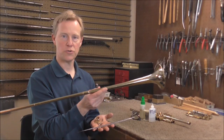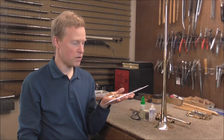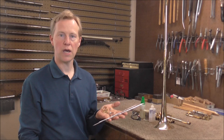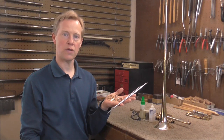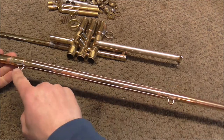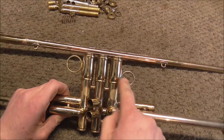The bell is in one piece and straight again after many years of being bent. I have six more pieces to solder on the instrument, but I've done so much soldering lately that I'm not going to bore you watching me solder six more pieces — I'll just do it and show you what it looks like when I'm done. Here is the trumpet: I soldered on the two flag hooks, the two braces, and on the valve section the two finger rings. Next week I'm going to buff, touch up the lacquer, and assemble it back together — and you'll also be able to hear the instrument played. I hope you enjoyed this video. Please subscribe for more band instrument repair videos.